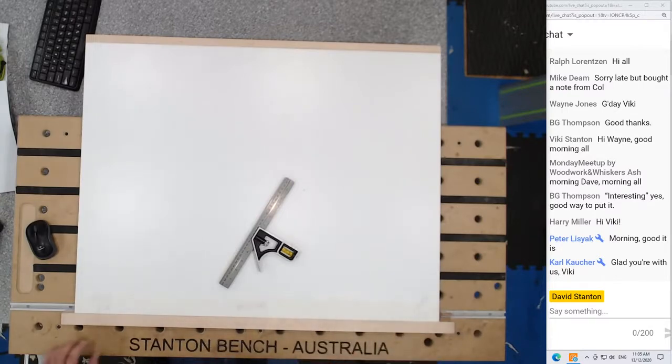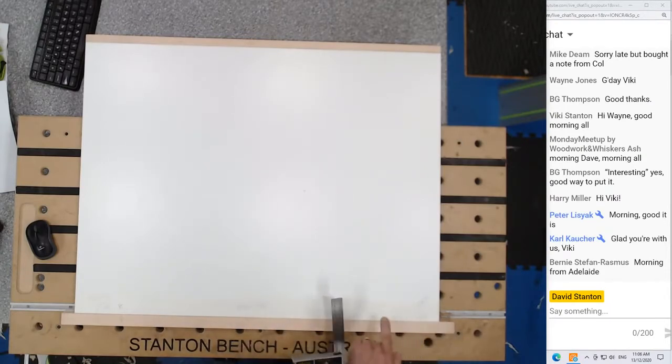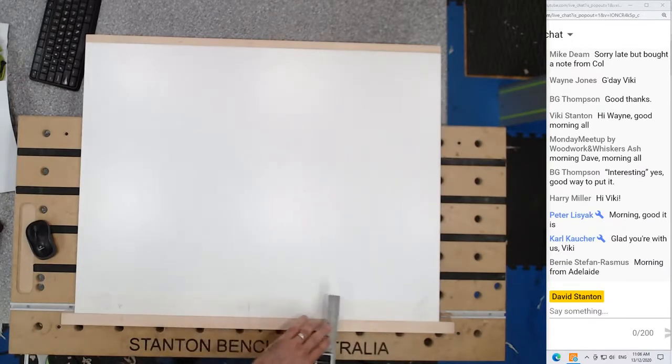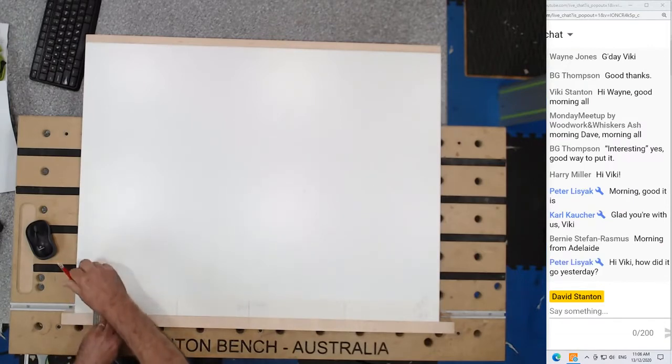Excellent. Next, I'm going to write A and A, but very lightly on the timber. Don't write heavily on the wood that you're going to sand. Then it's quite simply going to be lines across, and I'm not going to move the board at all. Go to the center, put a line there, and to the middle. Now this could be the marking for you to use a domino or a biscuit jointer or doweling, however you want to do it. Whatever you have available is fine.